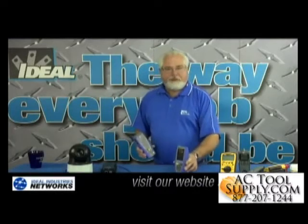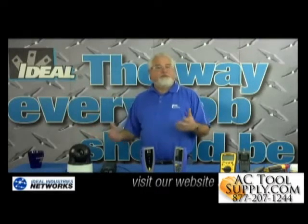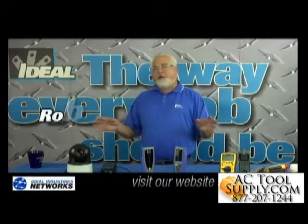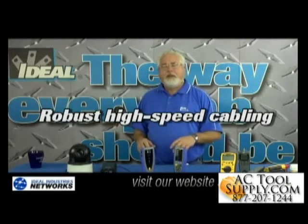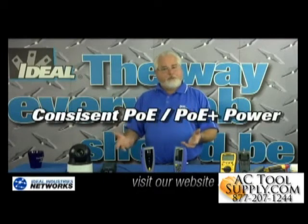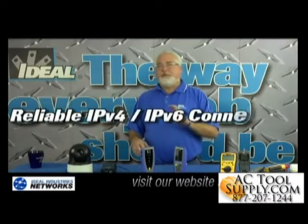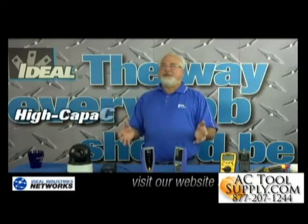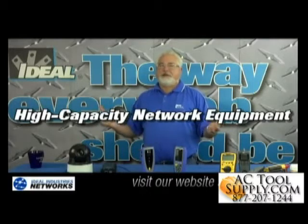System integrators have had a real challenge over the years when we test and try to troubleshoot these really pretty powerful mix of infrastructure components we need in order to support a pretty bandwidth-hungry IP camera system. Parts of this system include the cabling itself — we want to make sure it supports Gigabit Ethernet — and at the end of those wires we need to make sure we have enough power left over to support our Power Over Ethernet or PoE+ device. We also need to check IP version 4 or IP version 6 connections, and make sure our high-capacity network equipment can actually support all these cameras we're about to install.